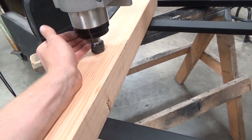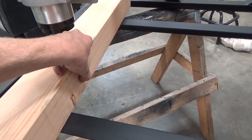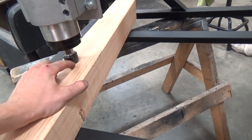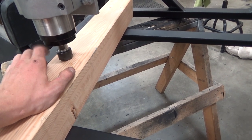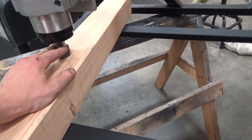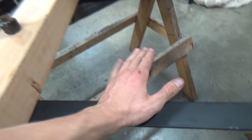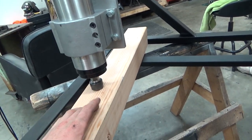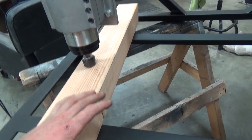So basically, with this 4 inches, if we have 1 inch of plywood on the bottom, and then 3/4 inch wasteboard plus tool, that equals a good working condition. But if you needed to reach down and mount something on only an inch of wasteboard, and it was a really short tool, you could move the spindle down in its holder, and you could still touch pretty much any tool to the frame if you needed to.